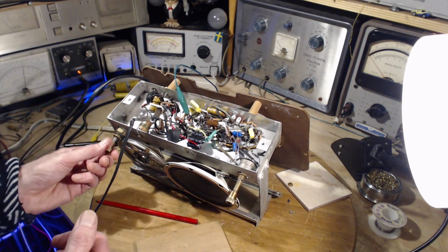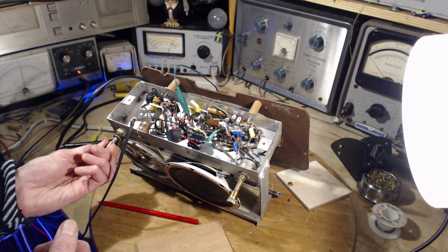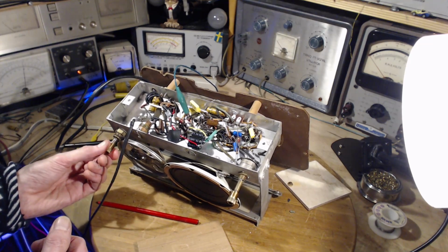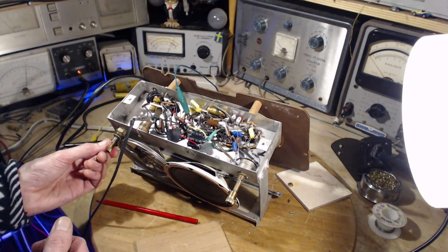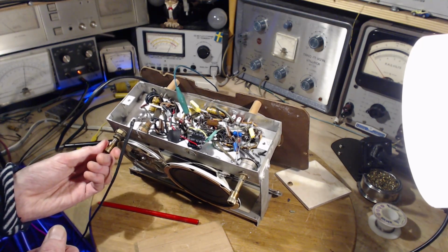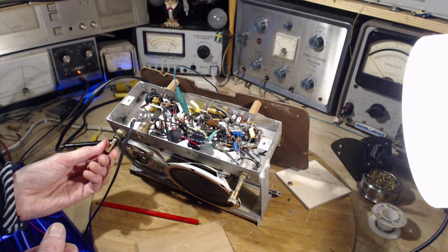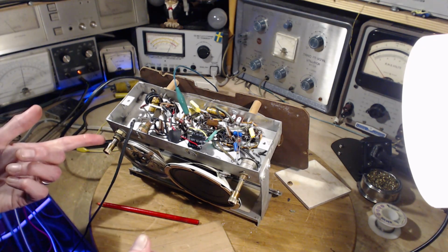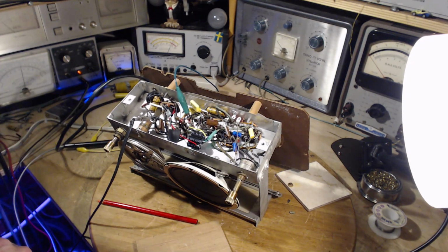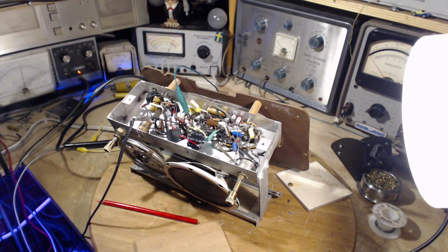It's just doing the same thing. Tune. Yeah, it's related to the capacitor. You know, that's a big hint. I'm just not getting it. Okay, stick it here. Touch that chassis. I kind of was already. Nothing going on. Then I have to remove this capacitor and try a tubular one here.